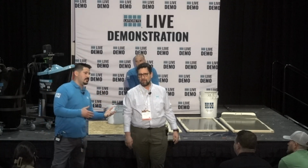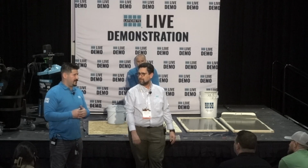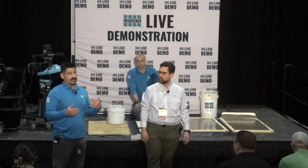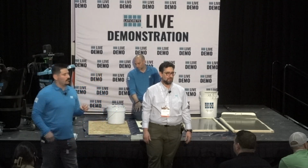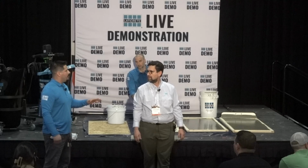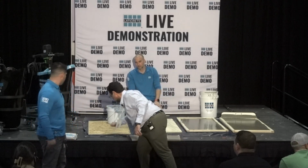And then we have our NXT primer, which is great for large projects. You mix it with water, so it goes a really long way, up to 1,500 feet with 5 gallons. You typically put that in a backpack sprayer and walk around and spray it on. It goes right into the substrate and gives you a really great bond. I honestly have never even heard of an issue with us debonding. It's a phenomenal primer.